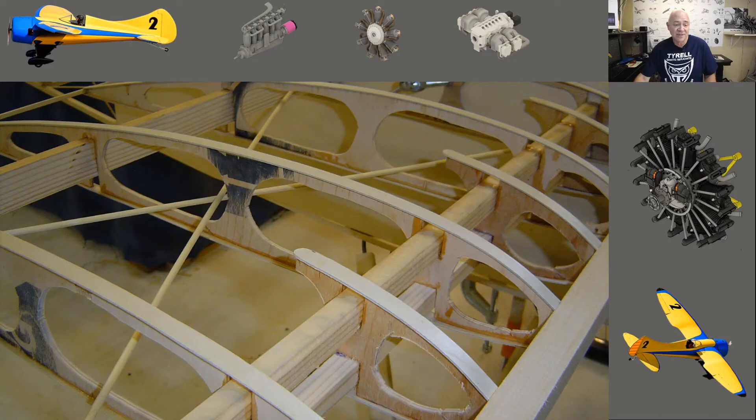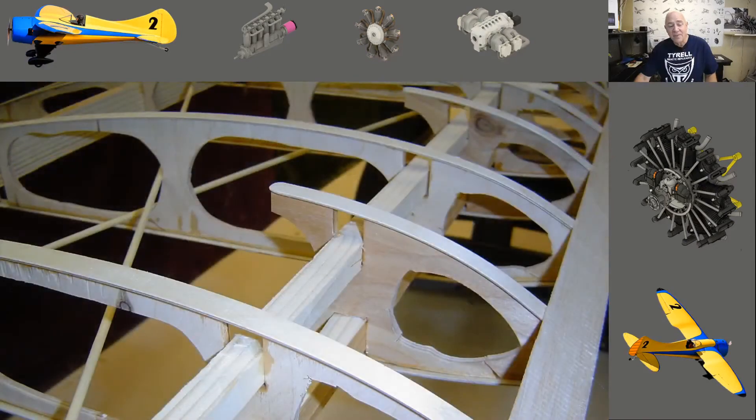You can see where I tried to sand off some of the paint on the ribs from the crate. The little caps on the ribs were 1/32nd plywood I already had. I wanted to build this plane absolutely on the cheap — the dowel rods for the bracing, just a really simple wing design. I was building this as a fast project, not one of my super scale planes. If I were to rebuild it nowadays I'd use all balsa wood reinforced with carbon fiber and probably keep it under 55 pounds to stay under the AMA rule.